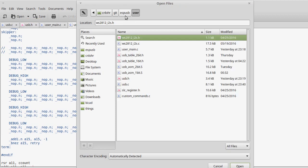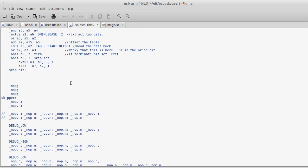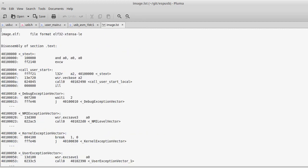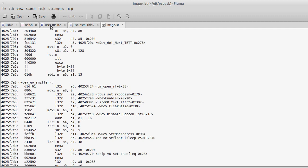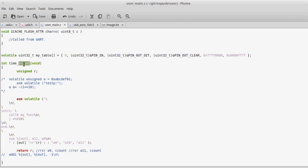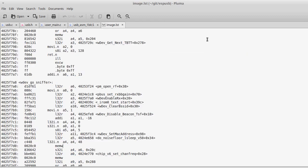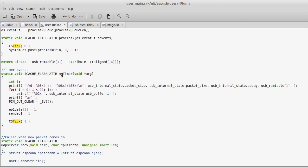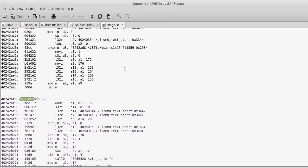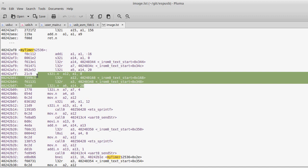What I am going to show you now, though, is the list file. One of the things I would do is start playing with my C code as I would start learning the assembly, and I would see what actually goes on. So I would write a small function and see what it looks like. Let's just see what this one looks like. I can write my C code, and then I can look at what the compiler decided to pop out assembly-wise.